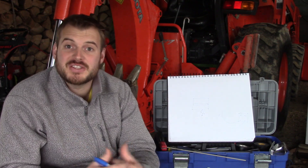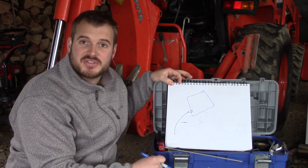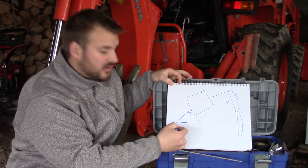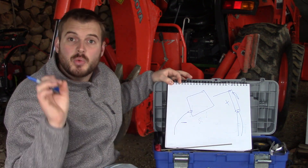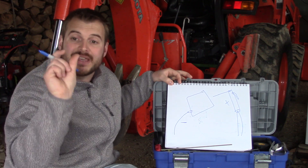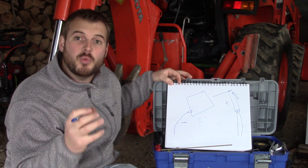To sum it up: you have a base material with a ground clamp connected to it — the negative side of the circuit. You also have an electrode holder with an electrode — the positive side. Electricity transfers from negative to positive. The gap between the base metal and the electrode creates resistance. When electricity flows through the atmosphere it creates resistance, which creates heat. That heat eats away at the base material, melts the filler material, and melts the slag, forming what you will have as a weld bead.